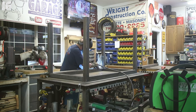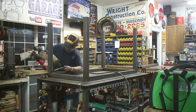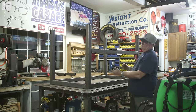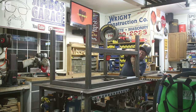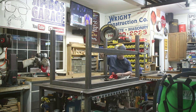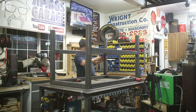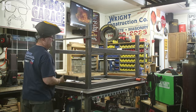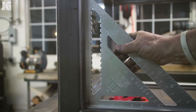Now putting the bottom supports of the bottom half of this table together and getting everything tacked into place. I do everything by myself and sometimes it's hard to hold things in place — these little handy mag squares worked out really well holding the supports in place while I get everything tacked in. I went around and made sure all four pieces were nice and even, true, plumb, and square. One last check of everything for square before we start the welding procedure, and I'm pretty pleased the way things turned out.